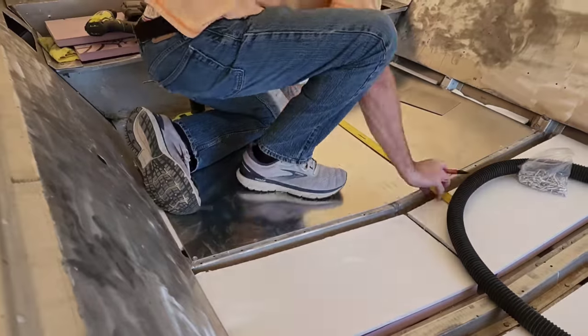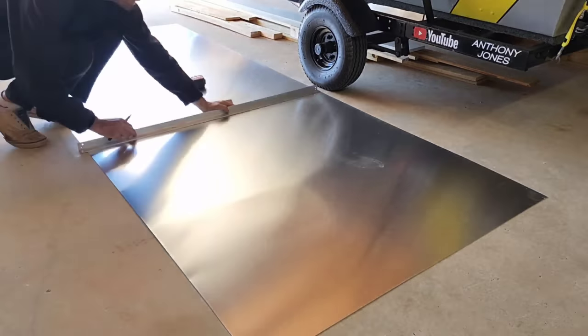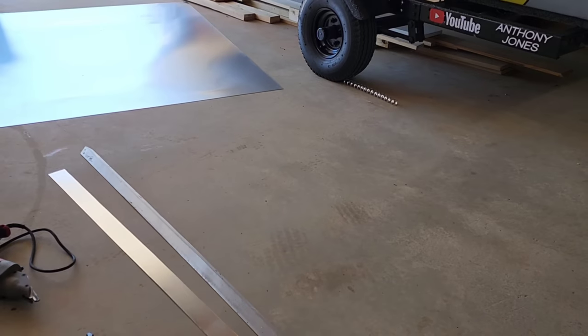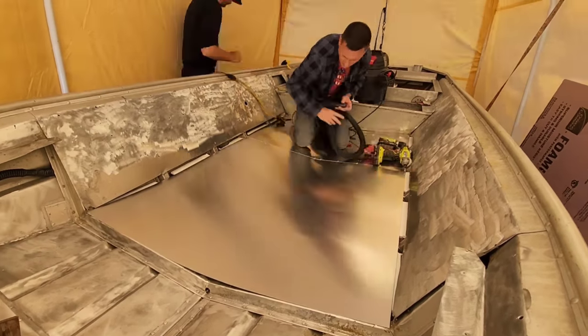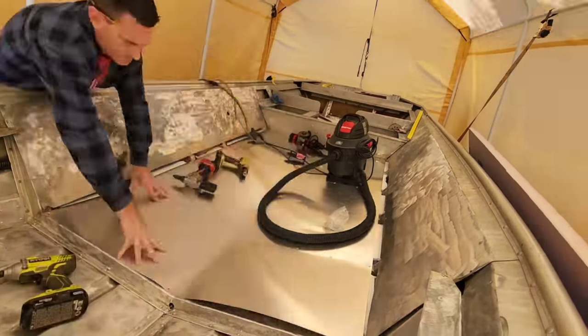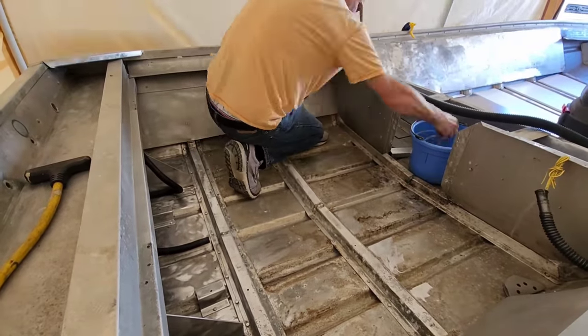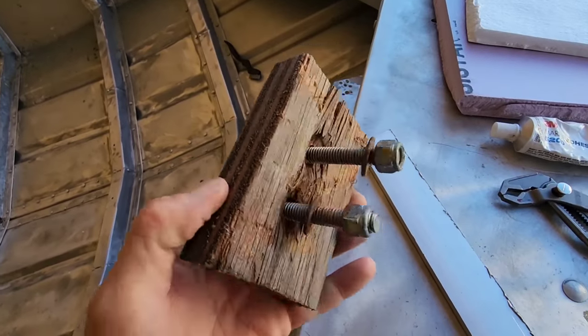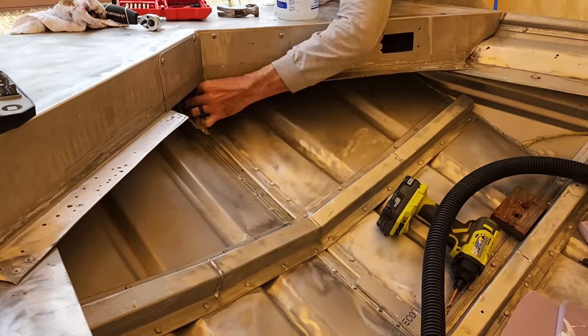To shed some weight, I did something a little different on the aluminum floor in this boat. We ran 090 sheet aluminum for the cockpit floor section. For the sheeting that would go underneath the front deck framing, I ran 060 sheet aluminum. We also got the transom area cleaned up and foamed, as well as the area underneath the jump seats. I removed the bow eye and old wood back and replaced it with 1/4-inch plate and resealed in 5200.